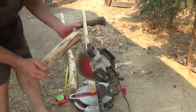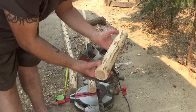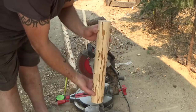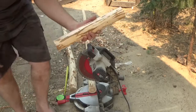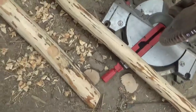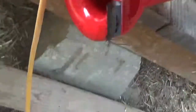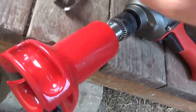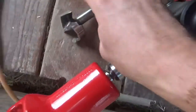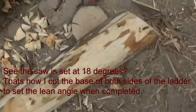I arbitrarily decided on 18 inches for ladder rung size. I'll give a couple inches on each side — an inch and a half to two inches — and still leave about 15-ish inches to walk in the middle. For my first attempt making a ladder, I busted out these pieces of equipment I'd never used before: this is the tenon cutter, and this is a forstner bit, which is what I used to drill perfectly round holes for seating the ladder rungs.